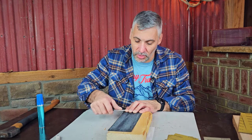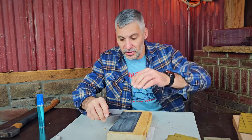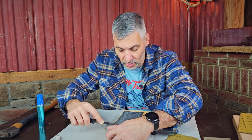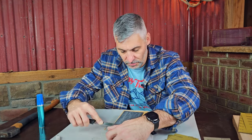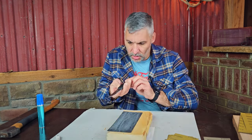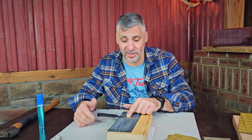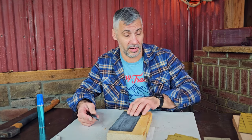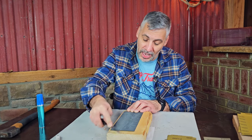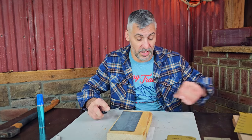I'm not going crazy, I'm not making this hard. You can feel it as you're moving — if there are any catchy spots, you feel if there's any parts that need some TLC. We want to be careful we don't push the flat part of the blade on there and scratch it all up — unless it's just a hunting knife or utility knife and you don't care. 800 a side, 1,000 on board now. I'm jumping grits fairly quickly. We went 400, 600, 800, 1,000.